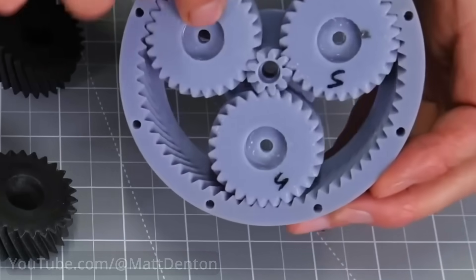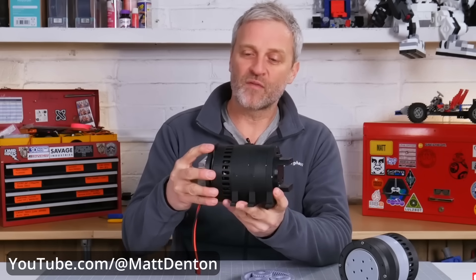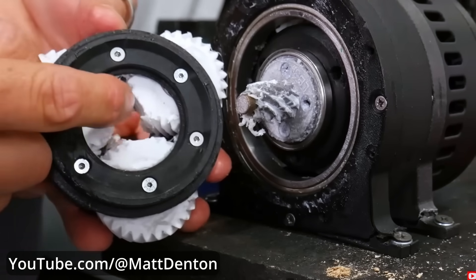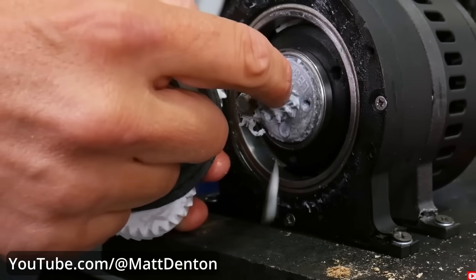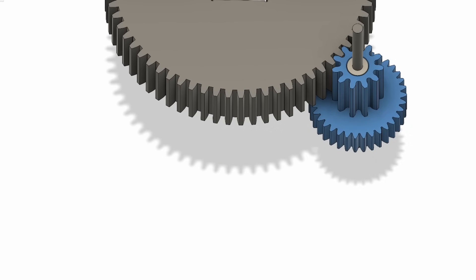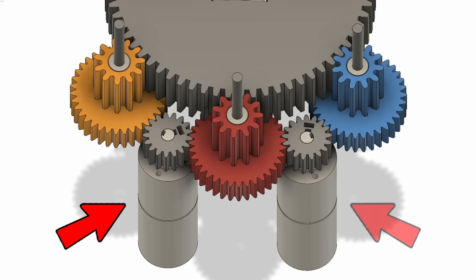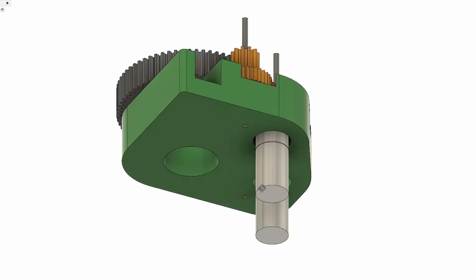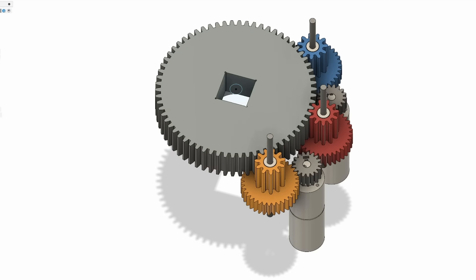For the new machine I've had a much better idea. Planetary gearboxes are a commonly used alternative where multiple planet gears mesh with the sun gear in the middle, but it's always the sun gear that breaks because it's attached to the motor. What if we turn the whole thing inside out? The motors are on the outside and the sun gear is the output that drives the robot leg. This means I can mix together multiple motors and have multiple intermediate two-stage gears to give a high reduction with the load spread across many more teeth. Since the AT-AT only needed two motors, we'll start with that.